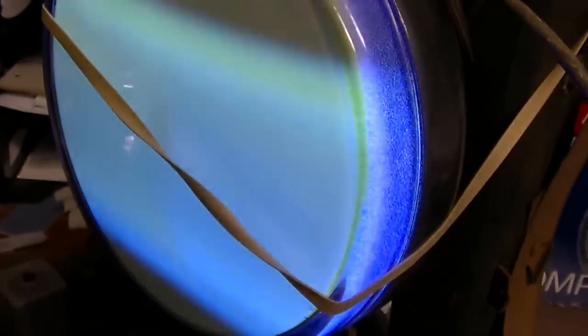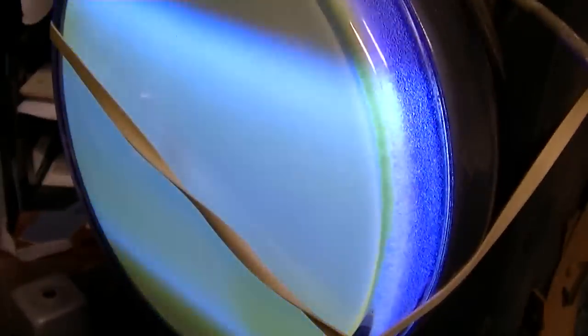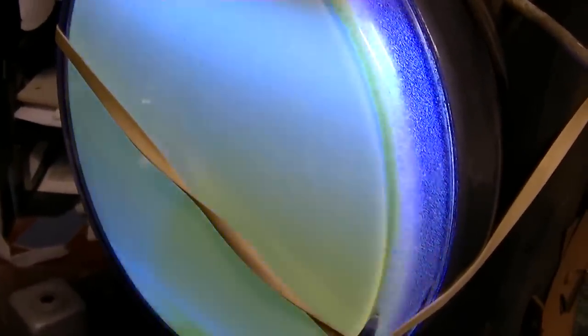I don't know what that is. And then this should be vertical speed. Yeah, that's working. So it's working now. It was just one capacitor keeping the vertical from working. What is so slow? I love the color though. Yeah, it's all working. The vertical is working now.